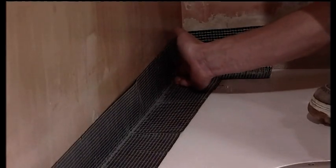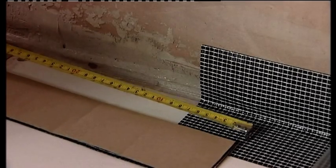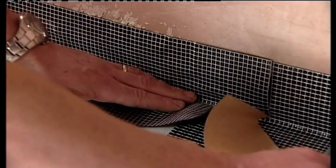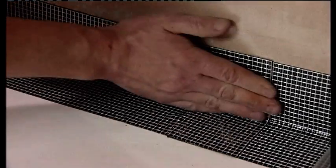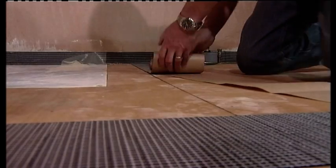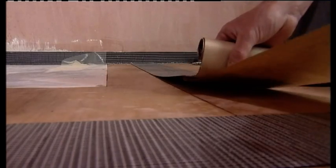The edging strips can then be applied, making sure there is a 75 millimeter overlap onto the corner section. It may be helpful to cut these strips into short manageable lengths of about a meter each. The second edging strip can then be installed in the same fashion, measuring accurately the 75 millimeter overlap. Once the backing paper has been removed, press firmly until there is a good bond. Once the tape has been applied to all the edges, the remaining floor is fitted with horizontal strips of joint tape applied to the floor at 1 meter intervals, making a type of grid.